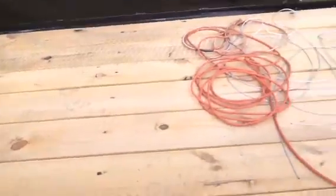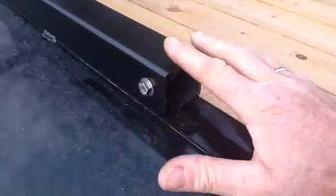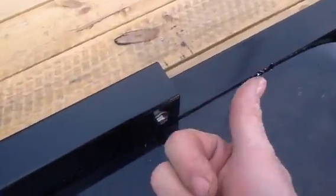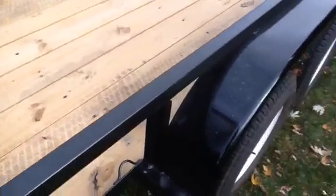It's real simple. Down here it's blue, so that means it's a 90-pound spring. This is a 5/16th bolt. All the hardware I used was stainless steel. The spring is inside of this tube, which gives it a safety factor. With the bolt back here, it can't go out that way if it breaks. And with these two rollers in the front, it can't come out either. So it maintains the spring in that area.